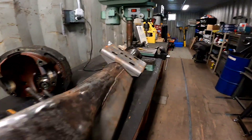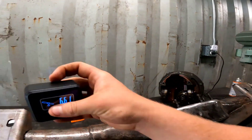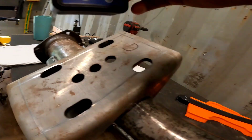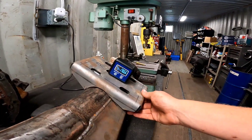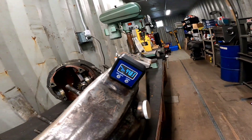I got both perches cut out — they're not perfect. But this one is at 30 degrees and I can move it a little bit. This one is at 28.65 degrees, and these I can still move ever so slightly back and forth. Coming to the housing, it is at 44 degrees, so I'm within a 20-degree difference. So I'm going to go ahead and bolt these U-bolt eliminators back up on the truck, bring the housing out, shove it up in there and see where we sit, and then do my pinion angle.